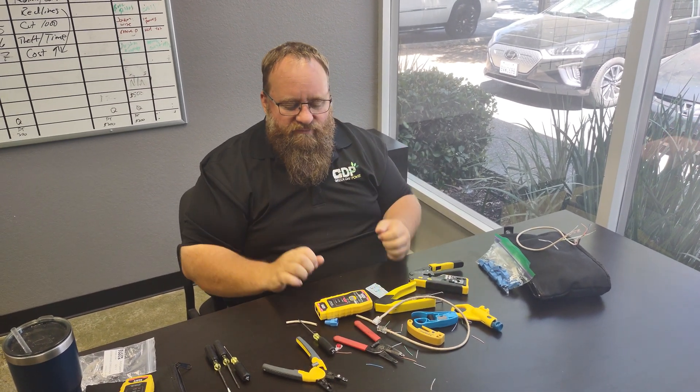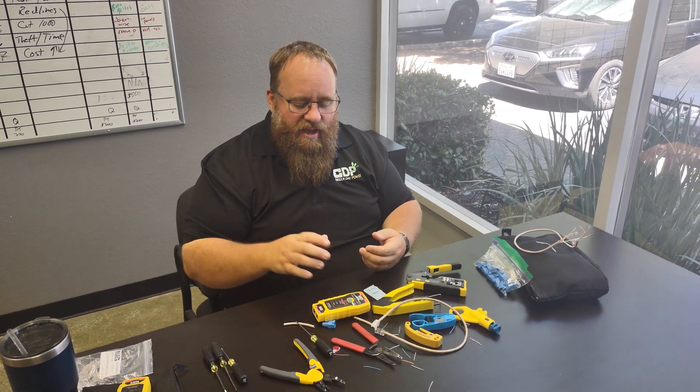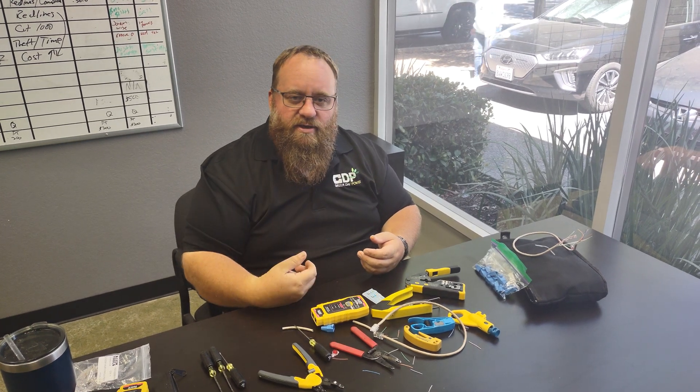You do need these tools if you're going to be starting to do solar in our day and age. We're doing more wiring with battery situations and more CT wiring, and you're going to need equipment like this for low voltage testing and sheath cutting. I've gone to jobs where people tried to cut their sheaths with their strippers and nicked a wire — and then it just doesn't get good communication and doesn't work. So really invest in yourself and your tools. Have a great day — like, share, and leave any comments down below.